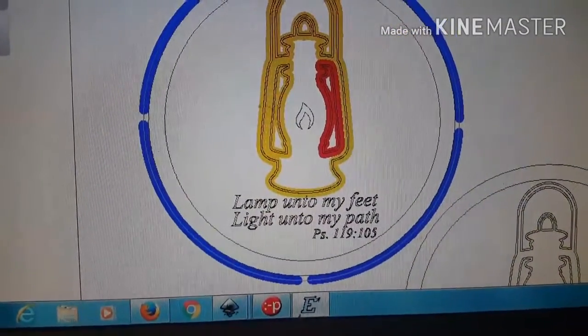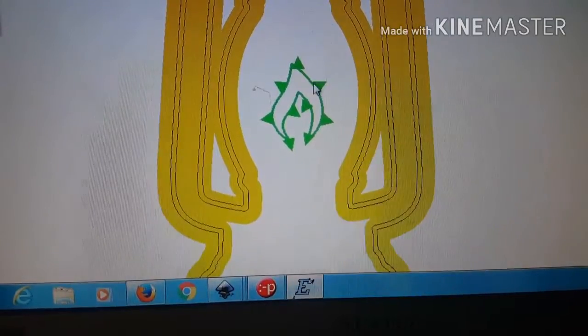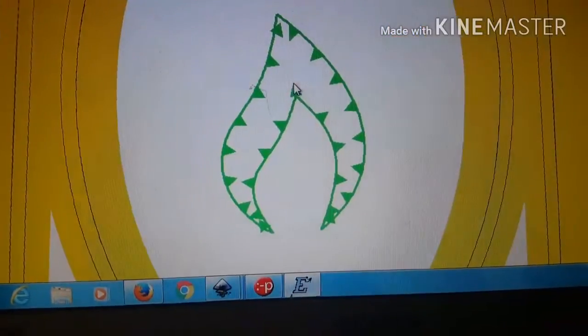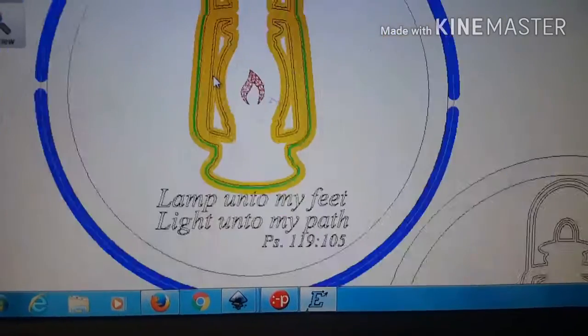Okay, so now the carve feature, same bit. Click this. You can see that's outside carve. That's both. Zoom in a little more and you get an inside carve, and that's what we want. Automatic depth limit. Leave the maximum carve width at the diameter of the bit.